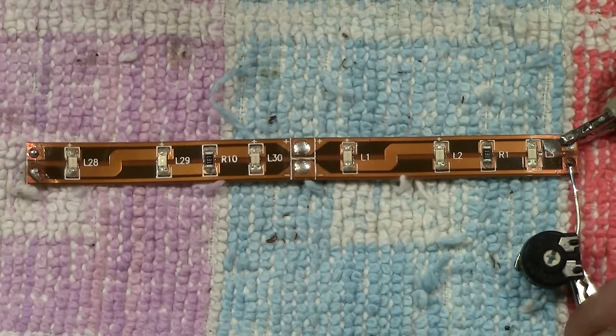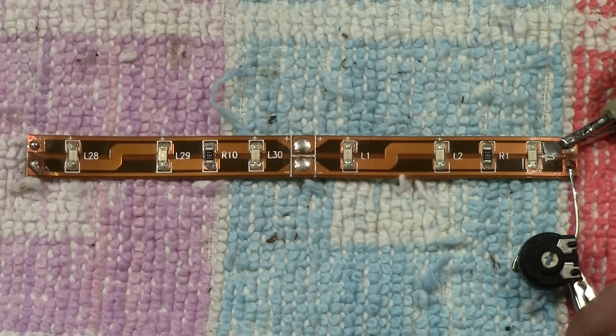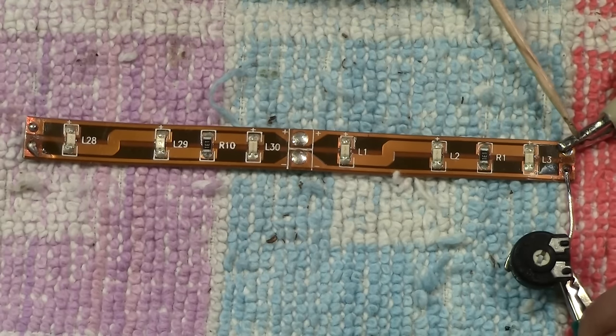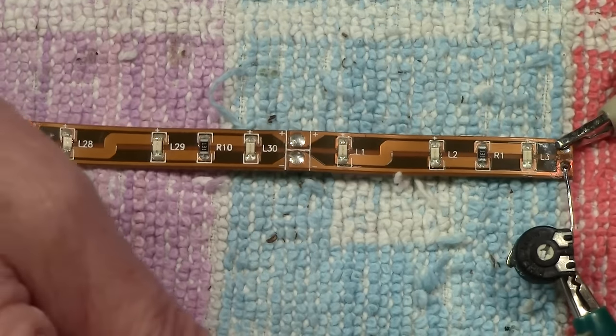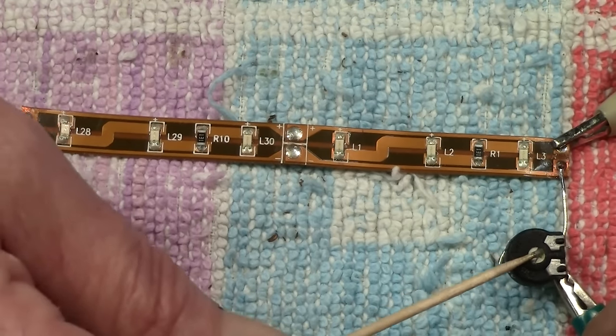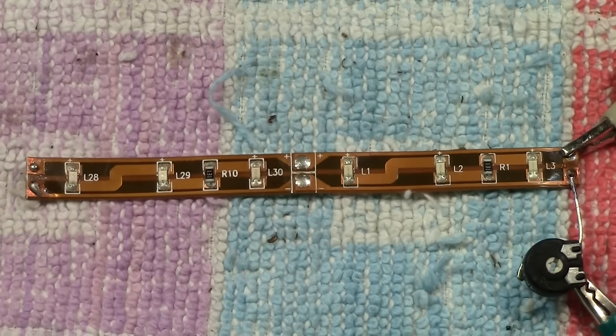Now that means then that we don't have to put a ballast resistor on, because like I say, they're already there on the board. And then, as you can see here, we've got one side of the supply onto there, I've got the other side of the supply here through this potentiometer. Now this one is 4,700 ohms, which is, you know, 5,000 ohms, 4.7k is the preferred value.